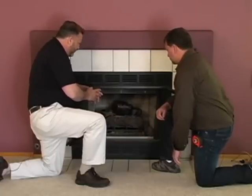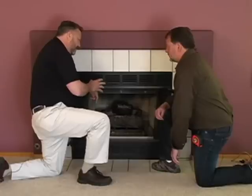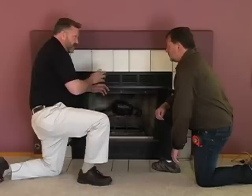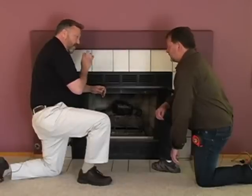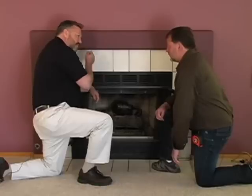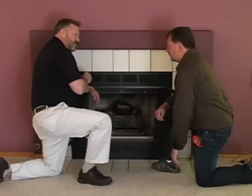More concerning is this gas line right back in here that's feeding this whole system — there's no sealant around that gas line. We find this in many home inspections, and it must be sealed. If this is a solid fuel appliance being used with the glass doors shut, it's going to starve for air. It's going to be reaching with its flame trying to get air, and actually transversing heat down that gas line. When that happens, you could ignite the paper on the insulation inside the chimney chase, which could cause a chimney chase fire. We find that quite often when we pull the caps off the tops of these.